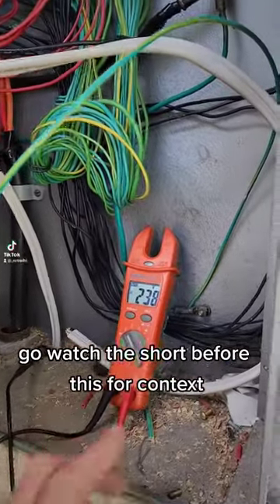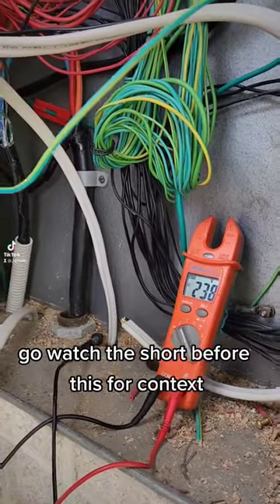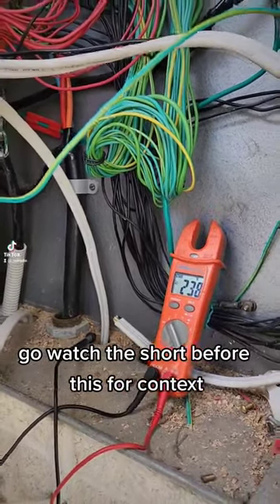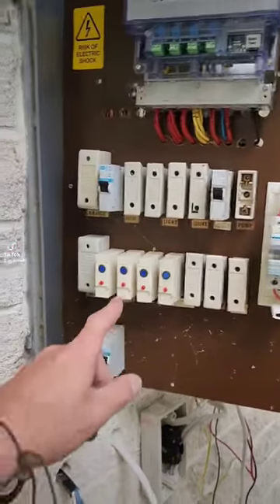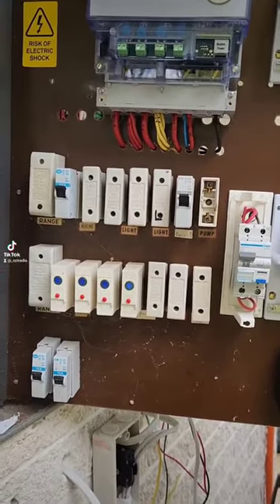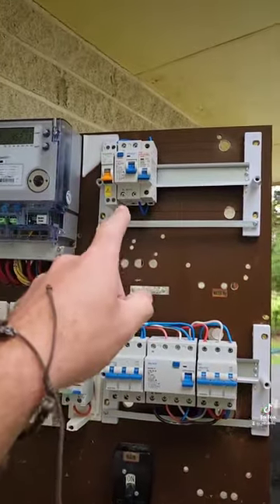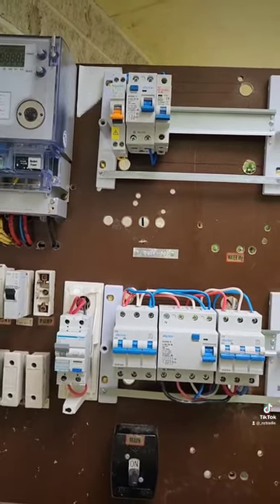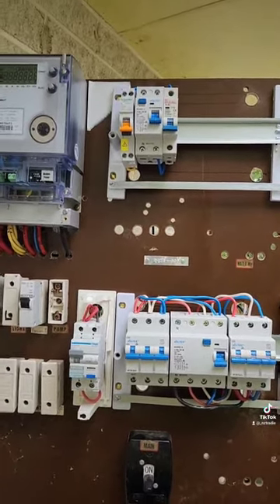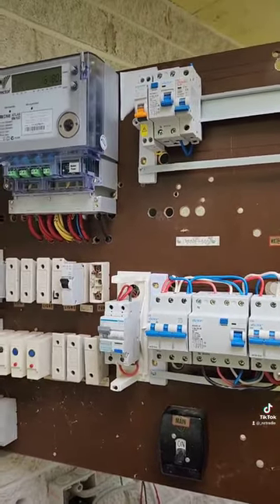You'll see that even though I haven't had to change any fuses, rewire, or flick any breakers, it's still live — and that's because some of these older style fuse protection systems are pretty bad. That's why it's important to upgrade to RCDs and MCBs. It's a regulation when you put new cables in in New Zealand, but for something like this where we're not changing anything, it's completely up to the customer.